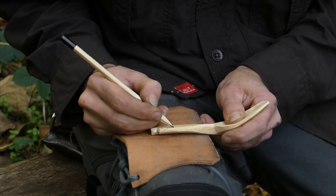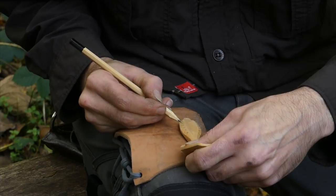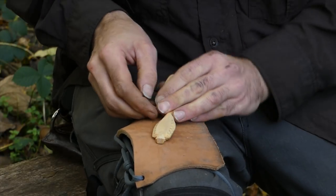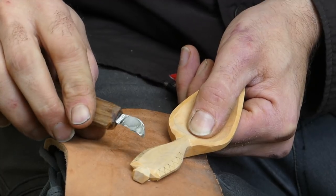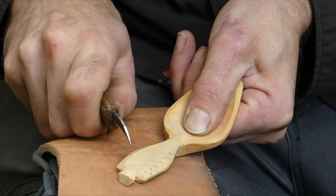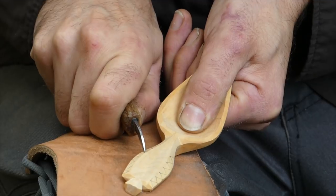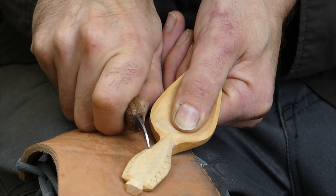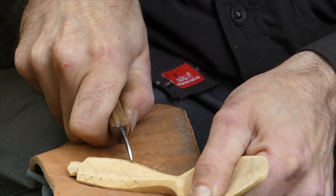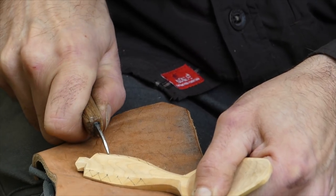we're not really going to be cutting a deep pyramid. What we're going to aim to do is push down with the knife from one angle. So I'm just going to take this little knife here, which is a sheep's foot blade, and press down so that I'm going quite deep in the thicker section of the timber and then just finishing flush with the edge on the outside from one direction, then come back in the opposite direction and make sure I put the point of the blade in the same place, and just follow those lines out,